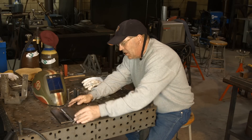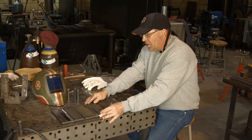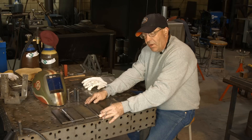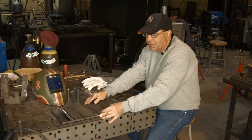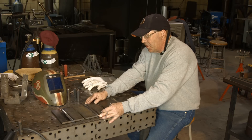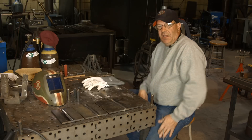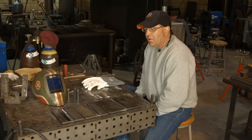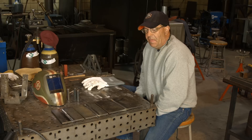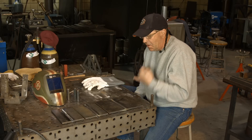There are a lot of variations you're gonna run into in the field. On a lot of jobs I worked independently — my own material prep, cutting, fitting, weld out, finish, everything. I was comfortable with that because I'd give myself what I wanted. As a fitter I'd ask welders what they want. On downhill pipeline, they want a "10 cent fit" — the thickness of a dime for the root face and a dime opening. That's cool because you can stick the rod in there and fly.